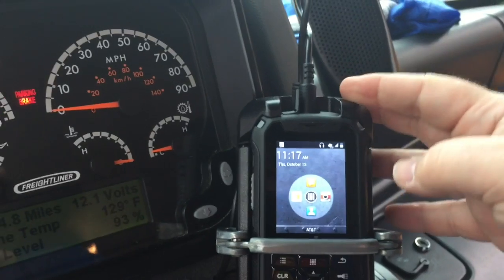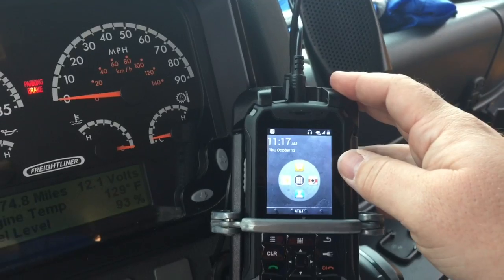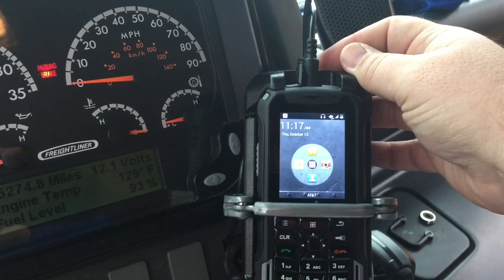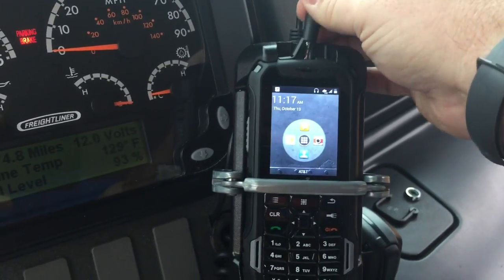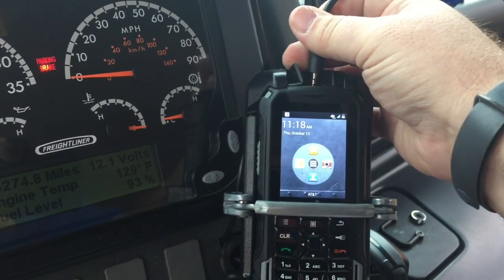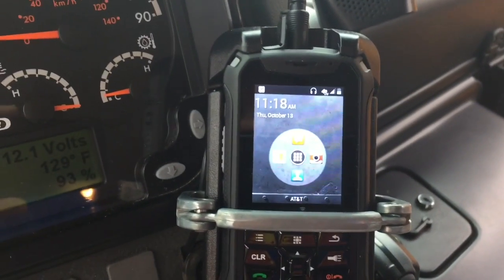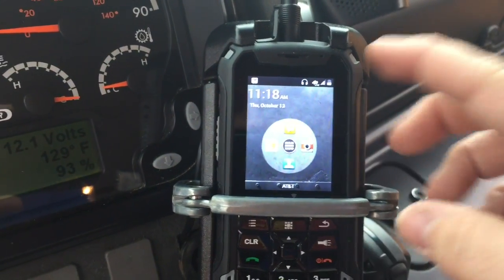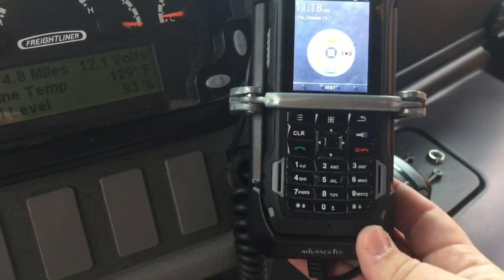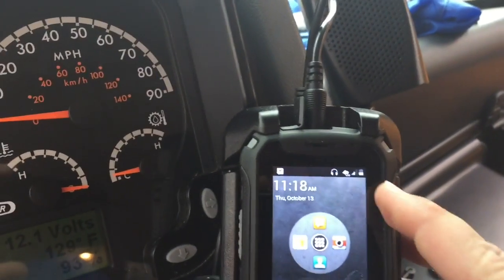Prior to replacing the junction box and the charging cradle, I had just replaced the junction box. And sometimes with that system, when we would turn the key on, the charging wouldn't begin, but we could simply unplug the grounding/microphone cable here and plug it back in, and it would begin charging again. With this particular charging cradle, it is not beginning to charge even with that. Also, checking with the connection down here, sliding it up and letting it slide back into position, it does not begin charging.